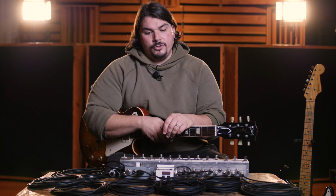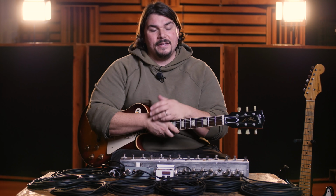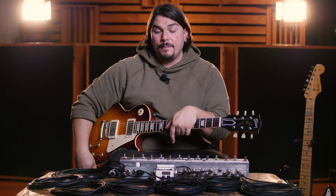It's just going to require high quality buffers, and the lower quality the buffer that you use, the more the quality of the cable is going to matter, and you're going to want to go with the lowest possible cable capacitance. So that was our patch cable shootout. This is something that I've been wanting to show you for a long time, and many of you have asked about this. How do I choose the cable that is going to go on my pedal board? Is that any different than the cable that would go from my guitar into my pedal board or from my pedal board to the amp?